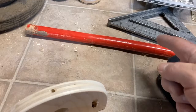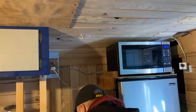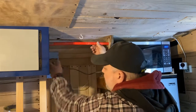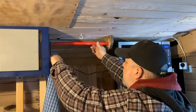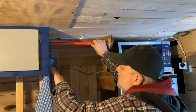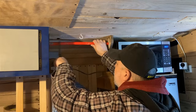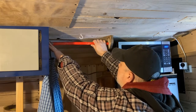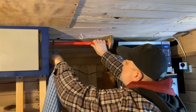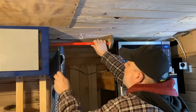I'm going to finish this one, then stain and assemble this for the bus — and I will explain why I'm leaving that red. For the final step, to determine my best location I lined this up. I'm using this side first because this is where my outlet is. I want to keep this stuff away from that as much as possible. When going down the road, if things are moving, I'll just unplug the two items in back — very easy. I'll put this side in first, then mount the other side using the pocket hole screws and secure it in place, making sure it's relatively easy to take in and out.